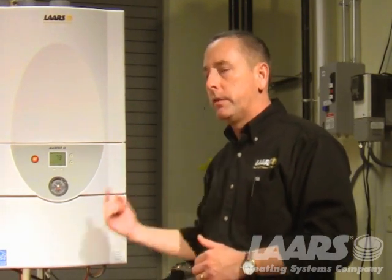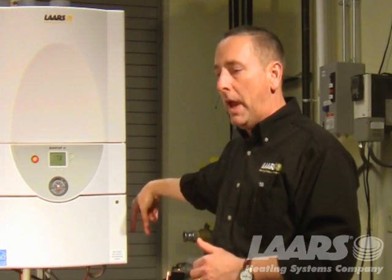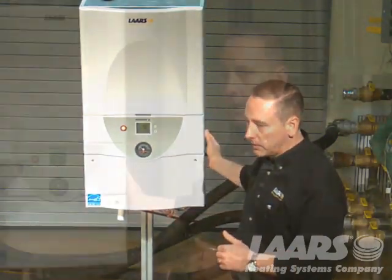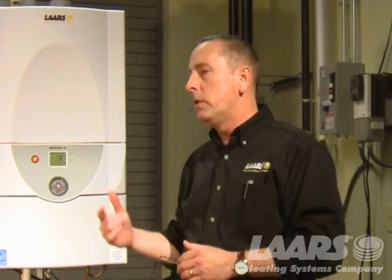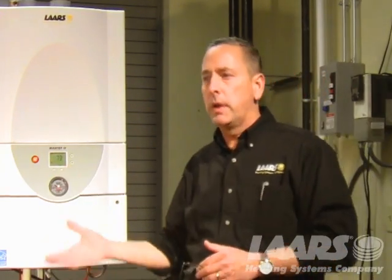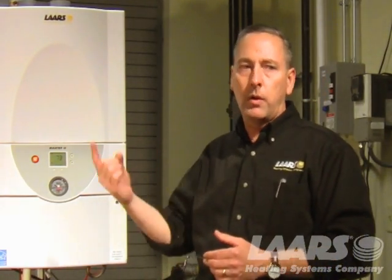All right. Now it's an indirect coil. You're going to take your heating pipes sticking out of the back of the boiler or the back side bottom of the boiler, which would have gone to a flat plate heat exchanger, which now is available for the indirect. When you choose that option, what you want to do on your domestic set point is you want to increase that temperature. You want to get that up to about 180 degrees. All right. That is your hot water coil going through your indirect tank. That's not your set point on your tank.